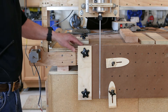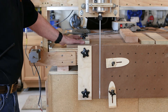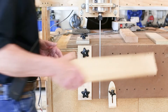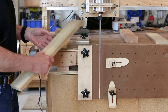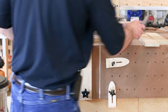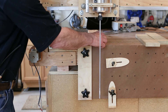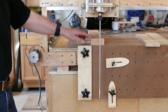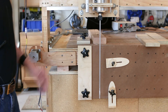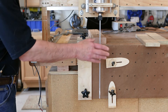I have two fences. I have a perpendicular fence — perpendicular to the table and parallel with the router — and then I have a horizontal fence. I'll show you what each one is for. The stock I'm going to cut, in this case a piece of poplar, goes against the perpendicular fence. Then to prevent tear-out I'll use a piece of 2x4 or trash material as a backer board, placed against the horizontal fence behind the piece I'm cutting. This setup is what I use to align my perpendicular fence with the router. This is just a piece of aluminum rod — a little bit flexible but it does the job.